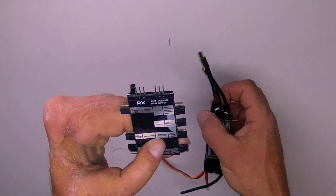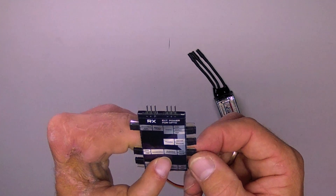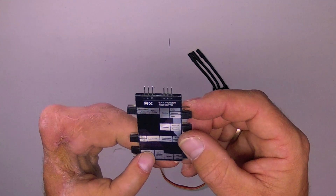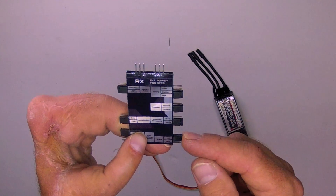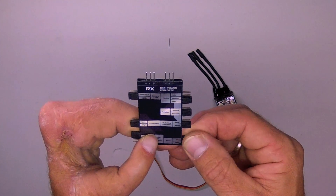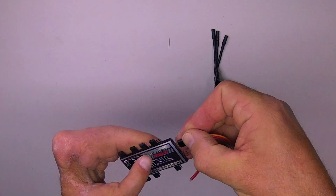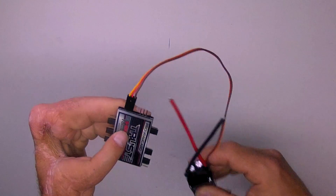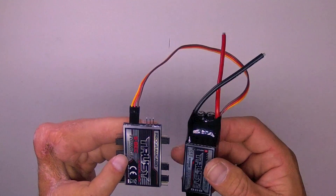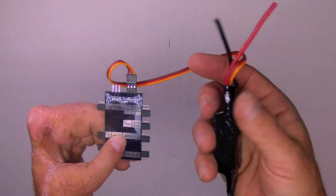It's nice not to have to swap the bullet connectors if you change propeller direction. Additional settings include switching frequency of 8 or 16 kHz, and the brake on or off. This is the most crucial setting, and it's easily done by moving the jumpers to the desired position, simply plugging in the speed controller and powering it up. You'll be met with a single long beep, telling you that all the settings you've just put in have been programmed to the ESC.